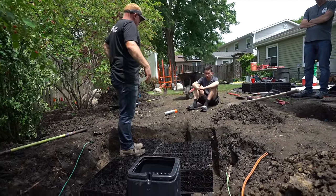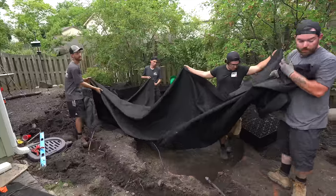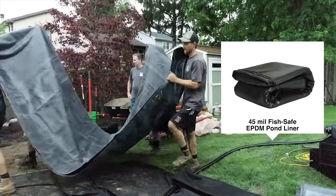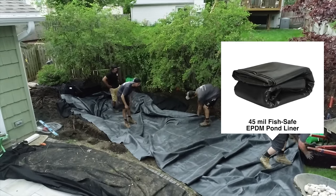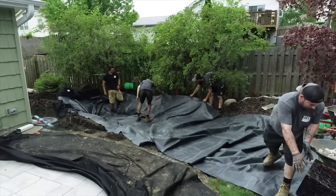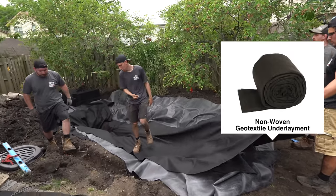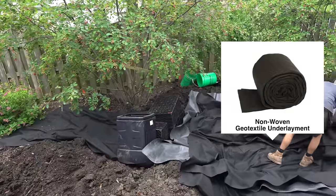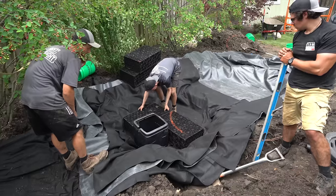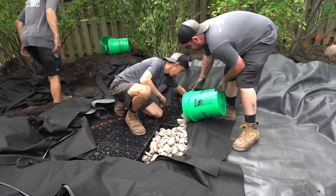This is going to allow space for gravel to sit and a little extra pooling water. The fabric goes down, then the liner goes down — here we've chosen to use one giant piece of liner that covers the entire space of the reservoir and the entire stream, avoiding seams and overlaps. Once the fabric and liner are down, we put another piece of fabric over the liner to protect it from sharp corners on the AquaBlocks. Then the vault goes in, the AquaBlocks go in around it, and we backfill with gravel.